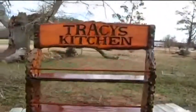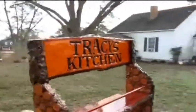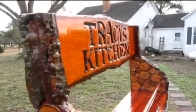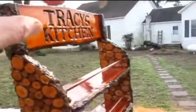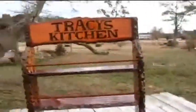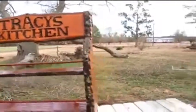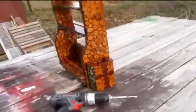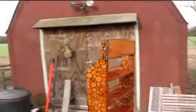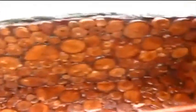Finally finished with the spice rack. I had problems up here where I ran out of polyurethane, so I put some clear gloss lacquer on it — and man, it ate that stuff up like acid. I came back out and it was all scrunched up, looked like rotten skin or something. So I had to resand that whole top part down, and then I used polyurethane — but it wasn't clear gloss, it was satin. There she is, getting ready to go hang her up right now. My wife is excited. See I put the little wood chips all over everything and polyurethaned the heck out of them to fill in the gaps.